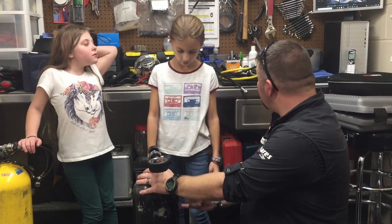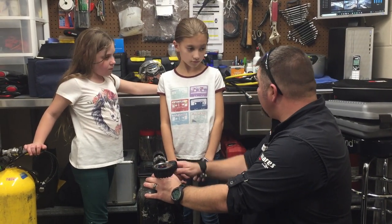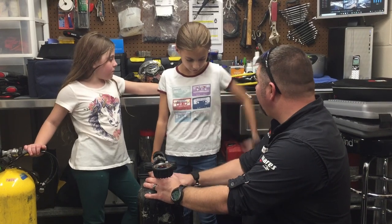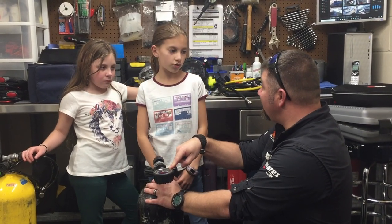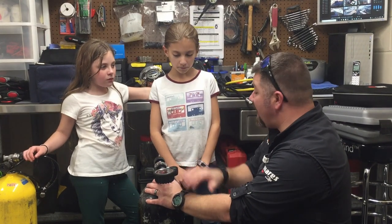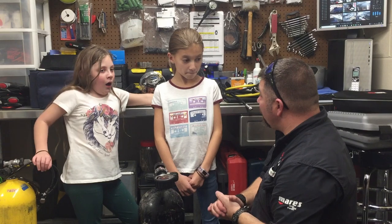It wasn't a string, it was like a metal rod, just a piece of metal. So if you were ever diving and you ran out of air, you'd pull down on that. That's right. And it would give you about how much pressure, or how much PSI, to get to the surface? 200. Right at 200 PSI, at least on this valve. Some valves did around 150, some did about 200.